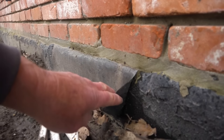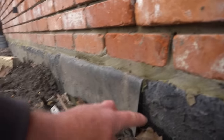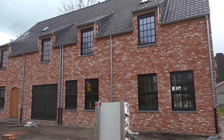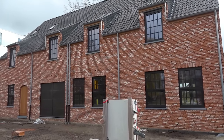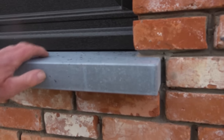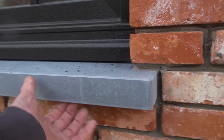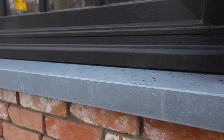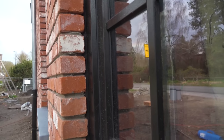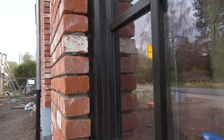Here's another interesting thing just on that concrete work — they've put another piece of damp proof course along there. I don't know exactly why, but it's obviously to keep the groundwater out from the underside of the building. Maybe it's a beam and block floor. There's a nice stone sill there — actually reconstituted concrete, but it looks pretty nice, all smooth and shiny.